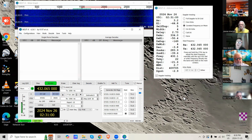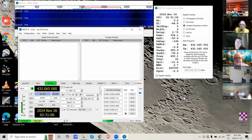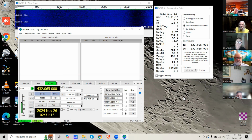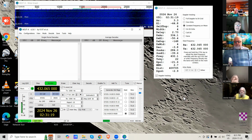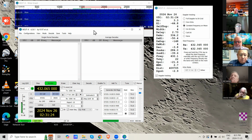I work a guy doing aircraft scatter during the week, and he's an EME guy, and he's always forgetting to do that. We're not decoding. You know, I said, well, if you got your EME delay on, he goes, oh yeah, and he unclicks it, and then it decodes. So if you are clicking that, remember that it's clicked. They should have a little flag come up, you know, delay on there, you idiot.